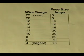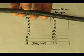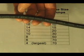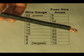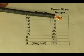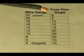Here's an example of a number four size wire — this big thick cable. You can be sure it's a number four by looking at the jacket and seeing the four AWG — that's American Wire Gauge — and that's how we know it's a number four. We're going to use this to supply power from our battery to the aircraft, especially for our starting circuit, which is going to draw a lot of amperage.